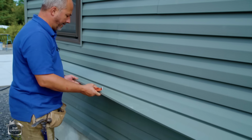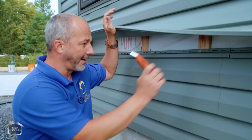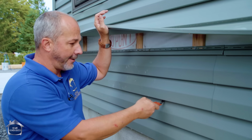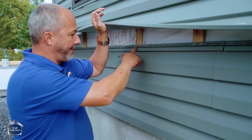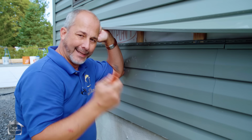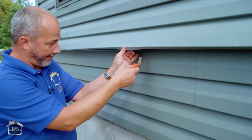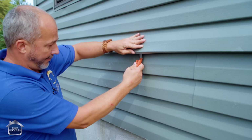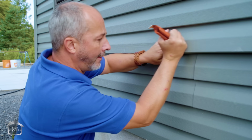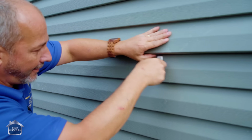Okay? Now look at, from here, if I had siding where it would miss some nails, I could just chuck those nails in, no problem. If this one was damaged, I could use the tool underneath, I could pull that seam, remove the nails, and pull the whole piece out. And then reinstall that piece. And all you need to do when you're done is put it back together. So you use the tool, and you grab the edge again, and you pull it down, and you push it in. All right? And all you do is you can run the tool along and push in behind it.